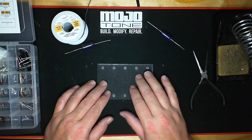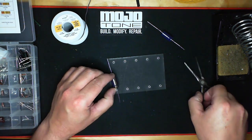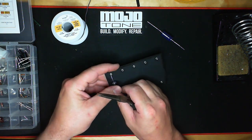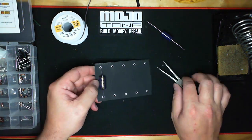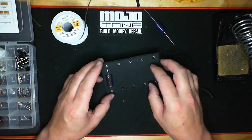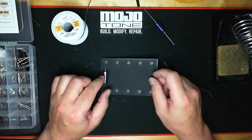Some filter cap boards will have a jumper running underneath the board as well. When I place components on the board, I try to keep things really consistent — I like to center components up on the board. I also like to have the information of the component visible just by looking at it, without needing to touch it. Notice the back side of this cap has nothing on it, but all the information is on one side — so you can look at it, read exactly what the component value is, test the component, and know which way is positive without touching it. That's another good principle that sets really good builders apart.